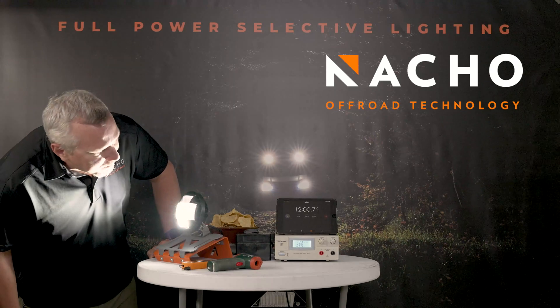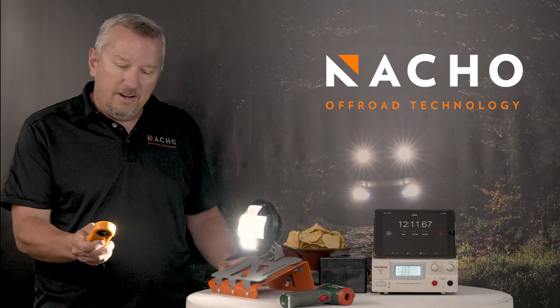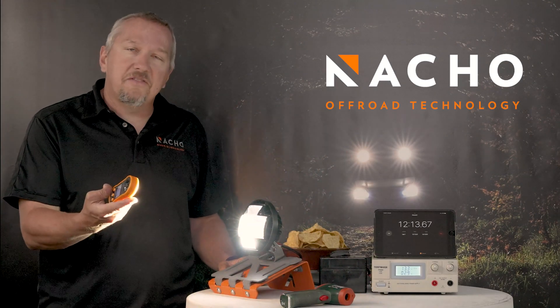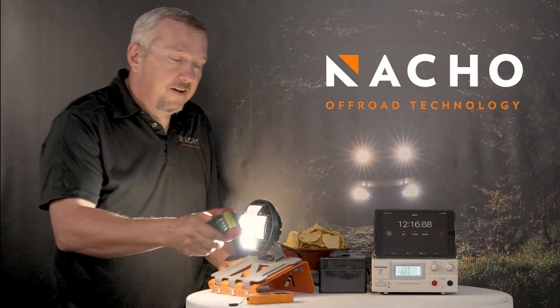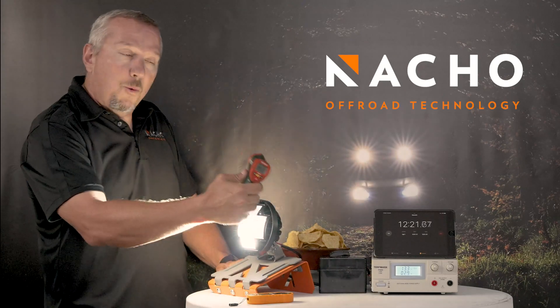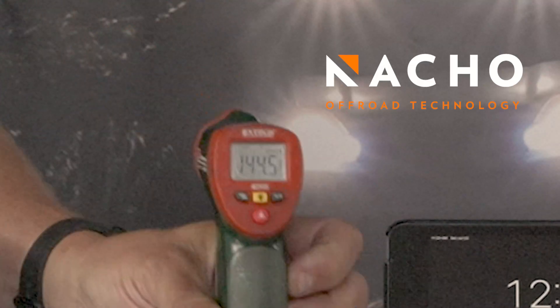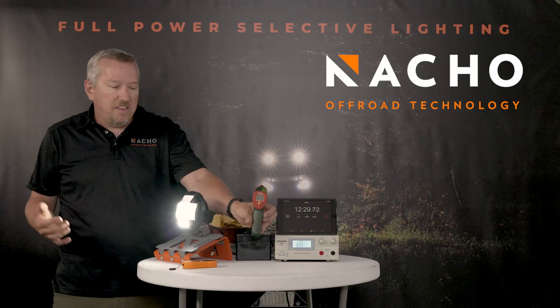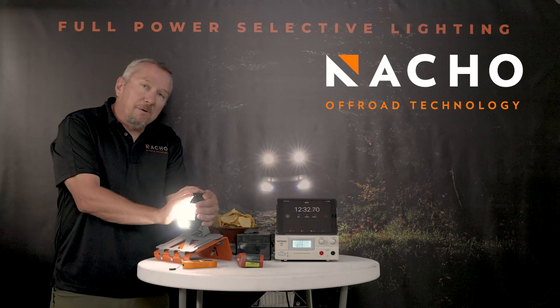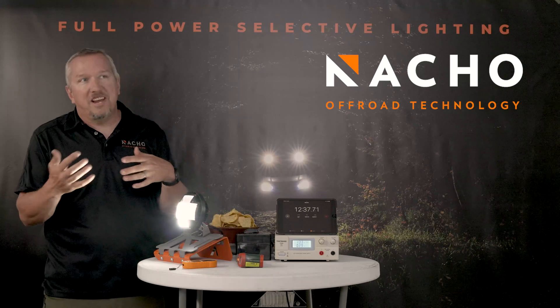After about 12 minutes, current draw stabilized right at about 3 amps — 2.93 amps. So about 50% power is where this light is going to stabilize. Let's check our temperature — it's probably about 75 degrees in here. Now let's check the housing temperature. We're right about 140, maybe up to 145 at the back. So nothing too hot — I can touch it, it's not going to burn you. If the housing's at 150, that means your LEDs are going to be right in that same range, maybe 160.